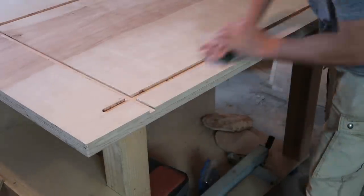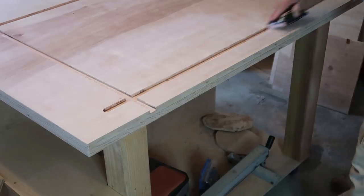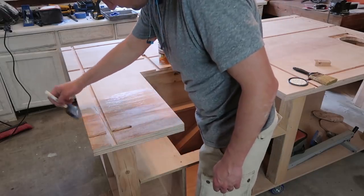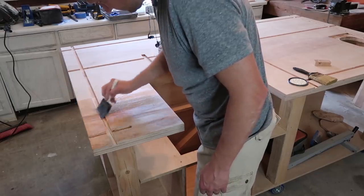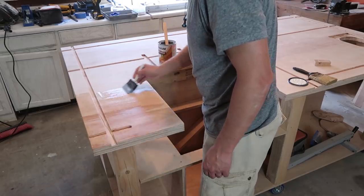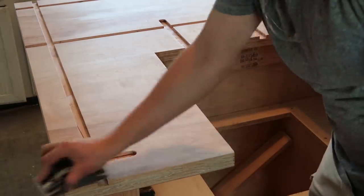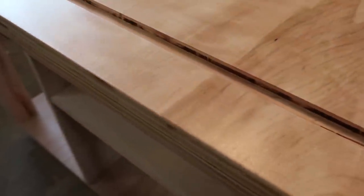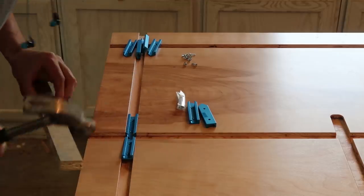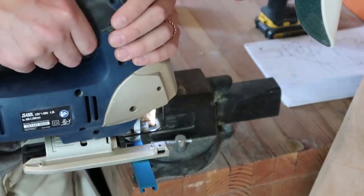Now that I have the Rockler Pro Lift in place, I'm going to sand the entire table with 120 grit to knock off those sharp edges around the plywood and where the T-track is set. Then I'm going to start putting on a coat of satin polyurethane — two or three coats, sanding in between — until it's nice and polished. I've got the top of the table finished with three coats of polyurethane, satin finish, and it looks amazing. Now I'm putting all the T-tracks in place, starting with the intersections, then cutting the other pieces to length to fit in the gaps.